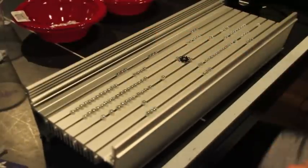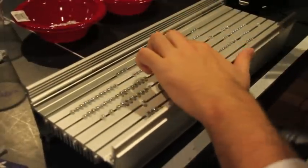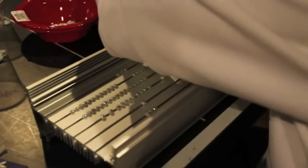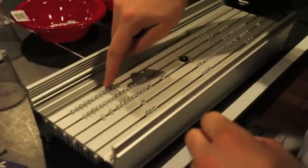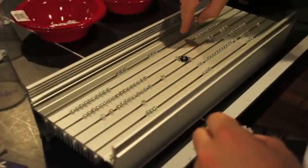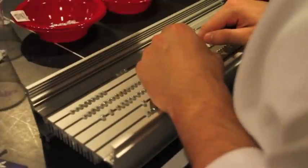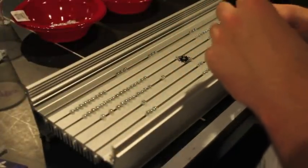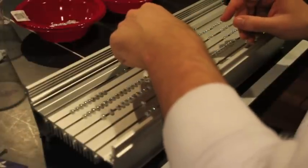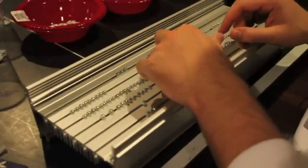Basically what I started doing is I started going by these rows. So the next one I'm going to do is blue — I'm going to do it right up here. So I've got my blues. I'm going to move these over since I kind of already screwed myself on these two rows. There is a little bit of adhesive — thermal grease — sticking out of the side. That just shows the smallest amount because you're going to be squeezing this to the heat sink as tight as possible to get a good thermal connection.